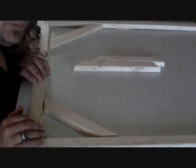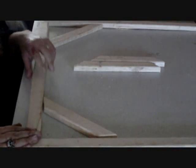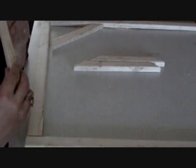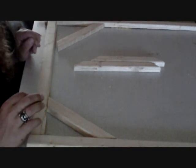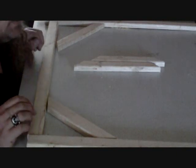As you can see, we laid it out. Our table isn't big enough to show you the whole thing — it's sticking out on one end — but this is the idea. A pilot hole goes from here into there, and this cross piece goes in between to hold the two frame pieces together. Regarding drilling: you don't want to go all the way through. If your drill bit is too big, your screw will let go. Only go in about halfway and be careful that you don't split your wood.